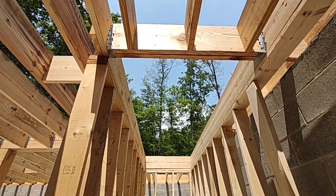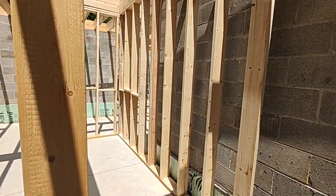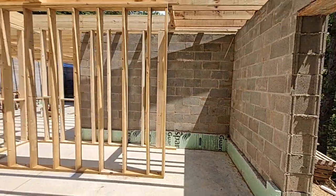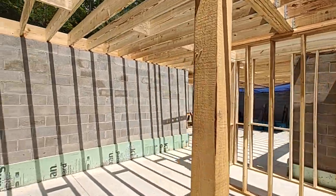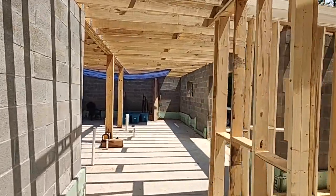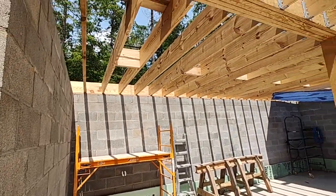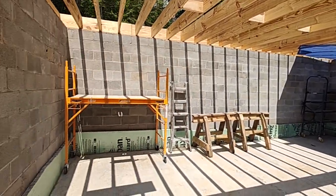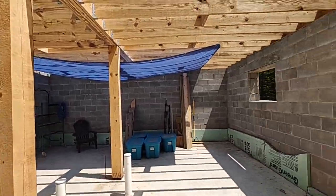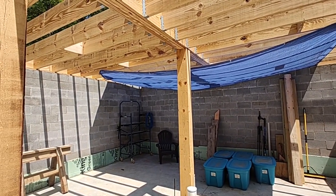You can see I've added the double joist hanger to the header on this side — didn't need one on the other side. I still need to add the single joist hangers to those interim joists. This is where the stairway will turn out, with egress to the outside through that doorway. Moving back into the other section: this is going to be a laundry room, bathroom, and dog shower — because we have a couple of dogs and it would be nice to wash them downstairs before they come up into the house. And that's the mechanical room I mentioned — that'll be where the electric panel is and most of the plumbing coming from upstairs. I ran this tarp because it gets really hot out here and it gives me a little respite for breaks or lunch.